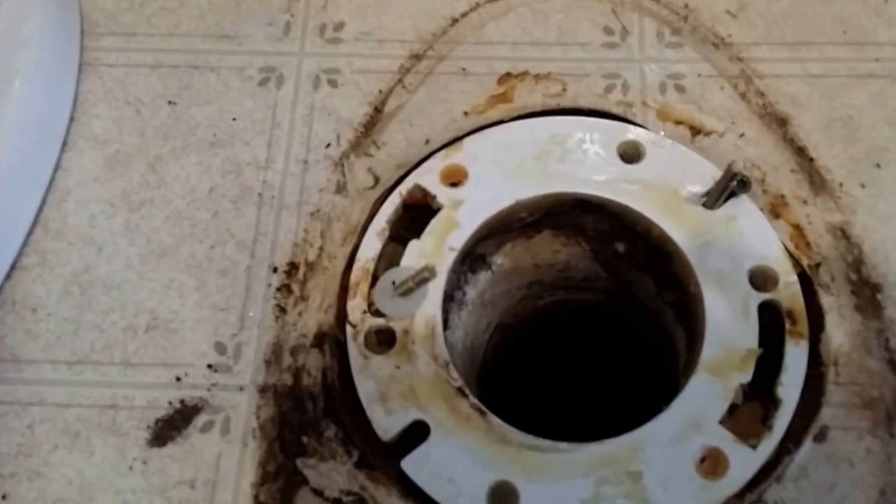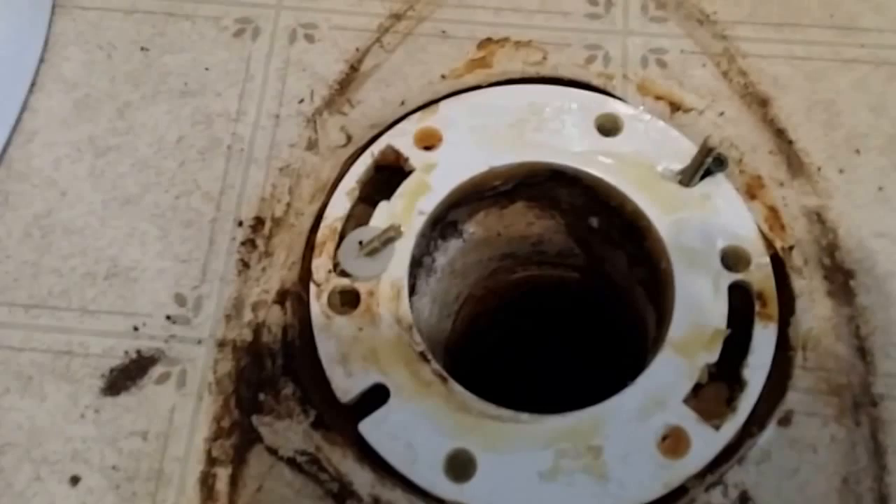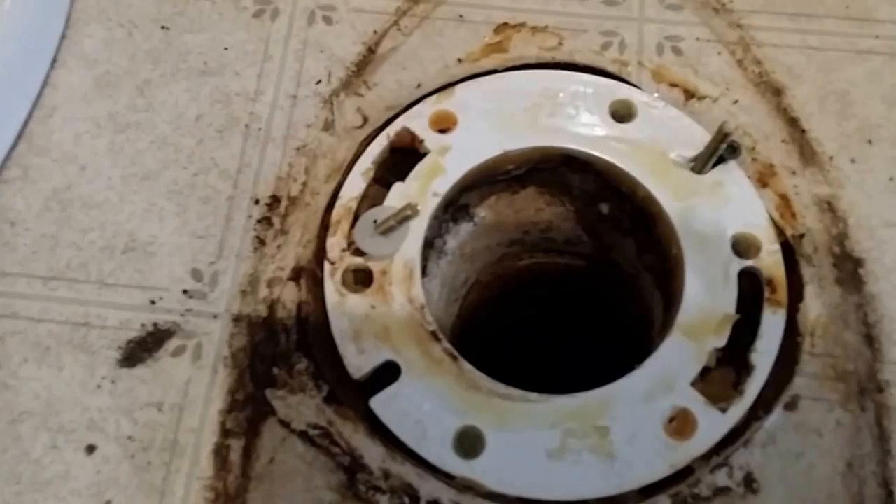That's in theory, because this flange is just fine. But all the older flanges, all they have is a hole there, as if you're going to put a threaded type anchor down into the floor. That's just going to come through it and it's not actually meant to be held by the flange. So in that case, you do need to have something to stabilize it.